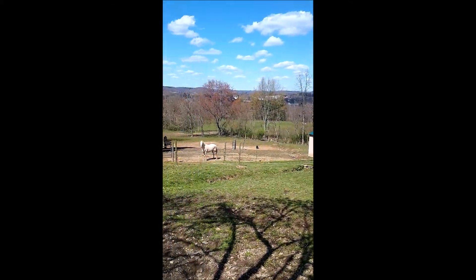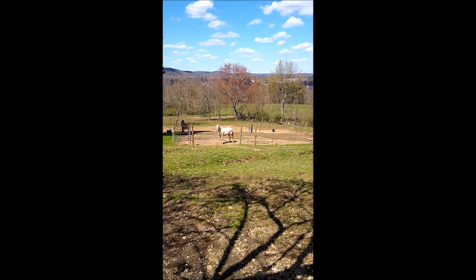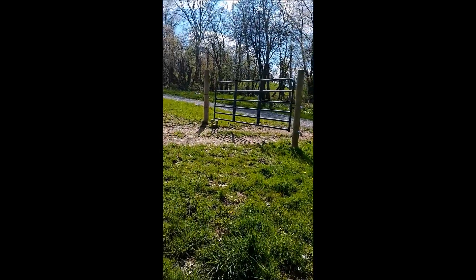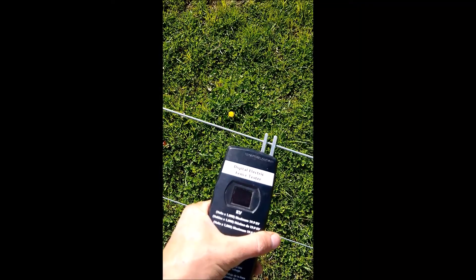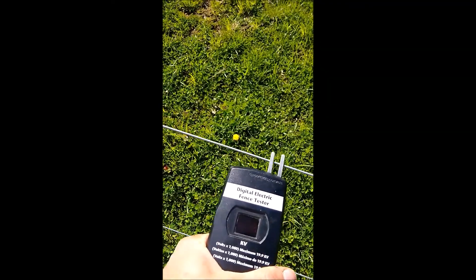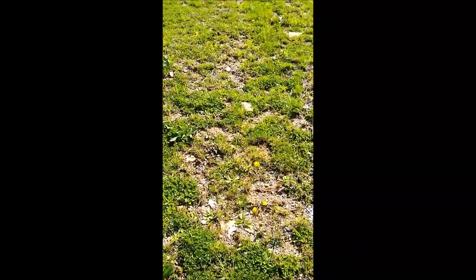That's running off the tester right down there, the little black box next to my horse. That runs all these barnyards down here and all the fences where the cows are. On the other side of this gate, all these fields run off another energizer that's up at the house, so I had to shut that one off to work on the fence so I didn't shock myself. My mom went back up to turn that on — let's see if we're getting anything on this side now. That one's a little hotter — we're getting about 5,250 to 5,300 volts.